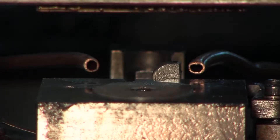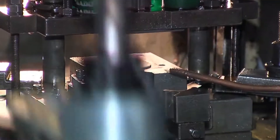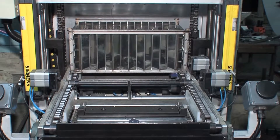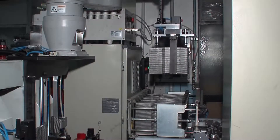The following stages are a final finishing of the pieces with various cleaning operations. First, the prongs, so as to stop traces of food from sticking to any roughness of the surfaces. Then the sides, which are specially rolled, so that when they are polished, they are nice to hold.